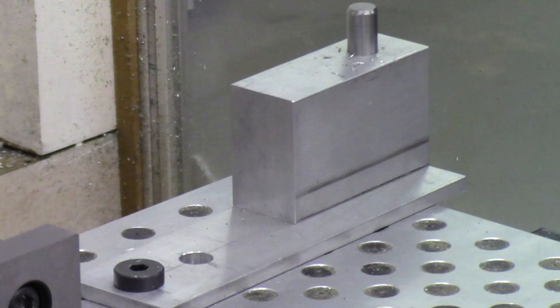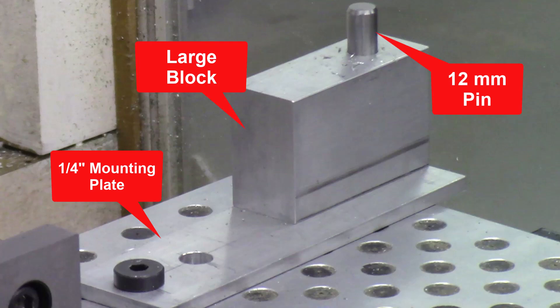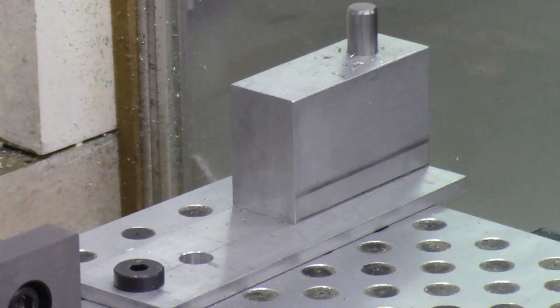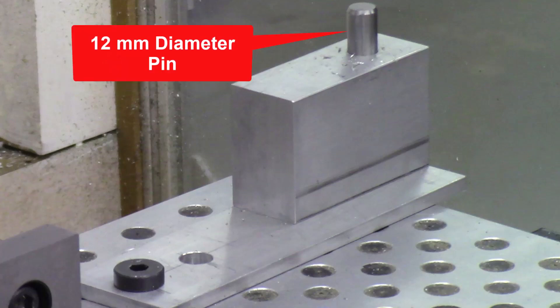This is a closer view of the custom drilling jig I designed and machined. The jig consists of a 1-1/4 inch thick aluminum mounting plate for the jig base, a large aluminum mounting block, and a 12mm diameter round pin extending from the top of the larger aluminum block. This jig is mounted to two holes in the mill table and slightly overhangs the end of the mill table in order to obtain the 25.5 inch drilling distance. The top of the large aluminum block was machined to be perfectly even and flat with the bottom surface of the two machine vices, and the 12mm round alignment pin was constructed from a 12mm diameter guide bar.